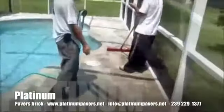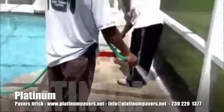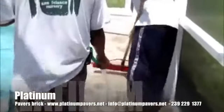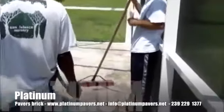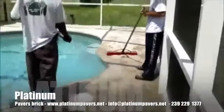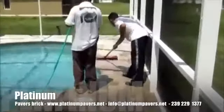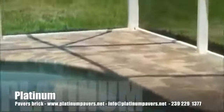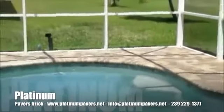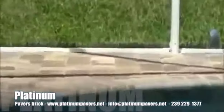The next step is to add a layer of sand to the top of the bricks and make sure to push that into the crevices and cracks, and also throw water on it so that it sinks deep in between the pavers and the pavers no longer move. After a long day of cleaning, we're done. As you can see, the pool is now leveled again and none of the pavers are sinking.